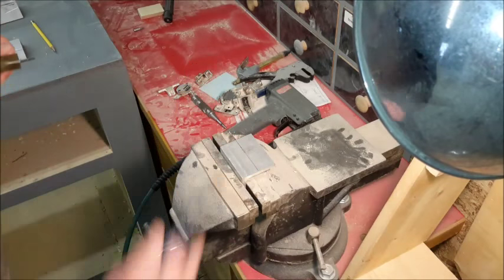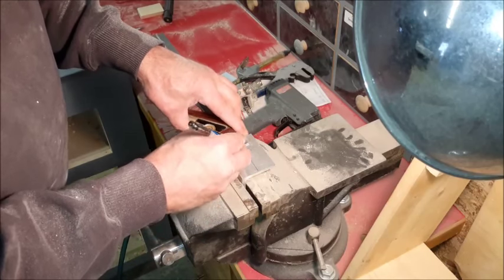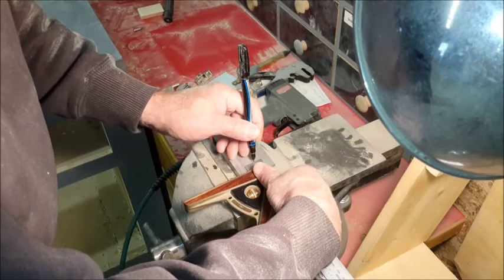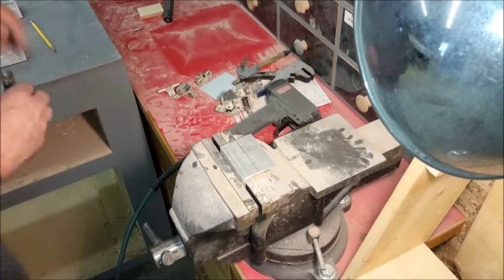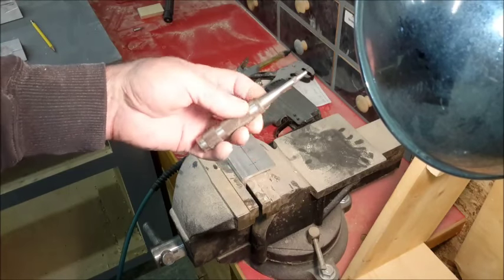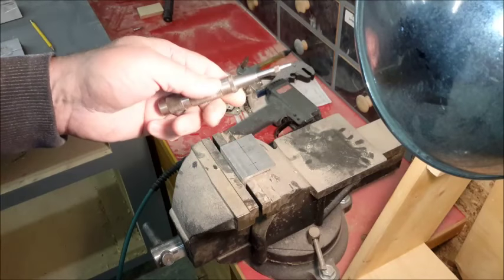I determined that I want the holes to mount the bracket to the cabinet itself about 5/8 of an inch from the edge or the ends. And what I do is just set the combination square. Again, this is not rocket surgery. Just get it close. And then I have, and if you don't have one of these, boy, there's a lot of things in this shop that you all need. This is a Starrett tool. I'm sure there are probably other manufacturers,